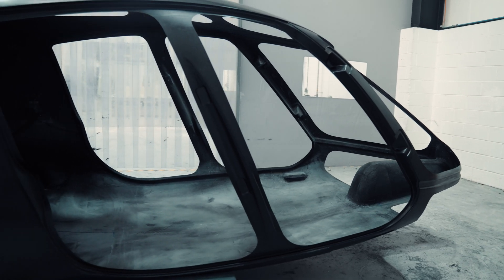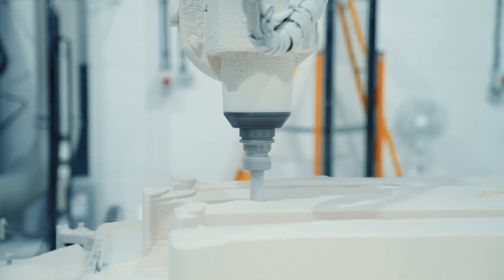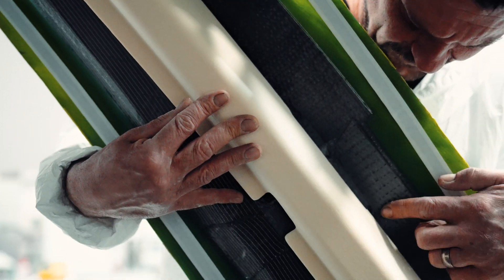I'm standing here in front of Airframe 3, which is a huge achievement in terms of detail — that was what we really focused on. Now Airframe 4 is shifting our focus a little bit onto the foams and the inner surface for the airframe. This is going to be a complete infusion with the A surface, the B surface, and the foams. The metallic inserts are to come in a further airframe, but this airframe is going to be a really big push to include all these extra details. Sometimes it can be a little bit like two steps forward, one step back — that's always the case in development. You learn new things and then apply what has already been learned to refine it, and that is exactly what Airframe 4 is going to be like.